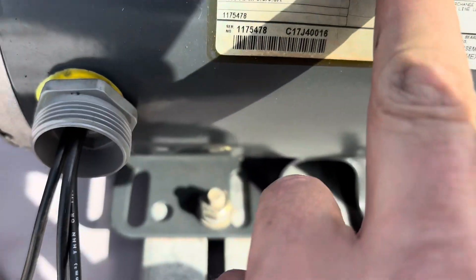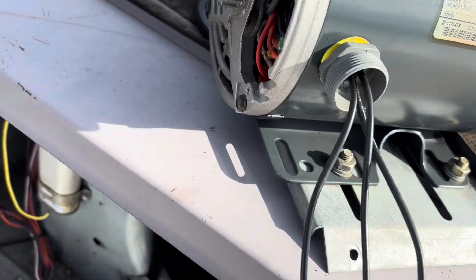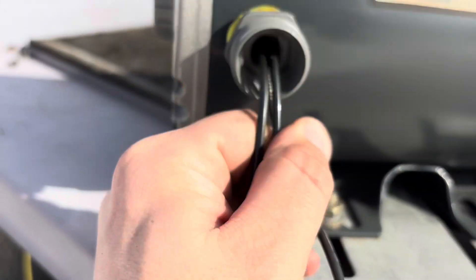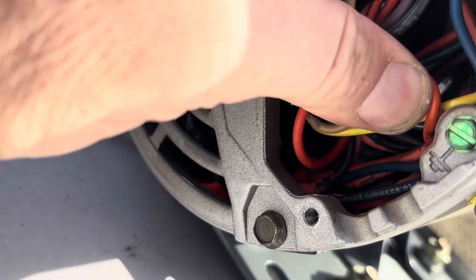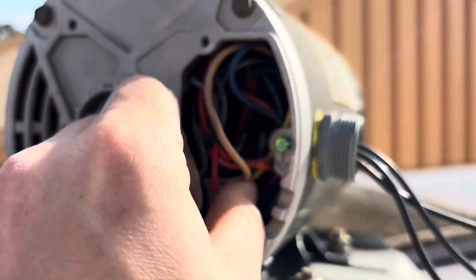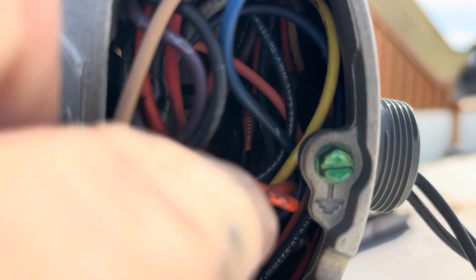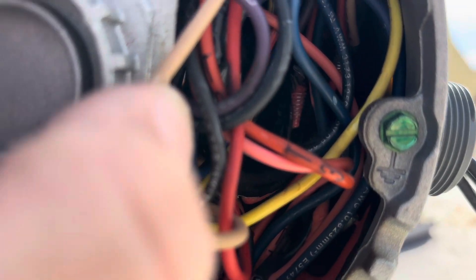She got hot. They gave me a new pulley too, which I will use so I don't have to take that one. Three wires connected somewhere here — damn, she got hot in there. Yeah, all these are stuck together. Trying to see where the hell they connect at; we'll have to pull some stuff out of there. She's all melted in there. The wires go in here but then they just disappear. Look at all this melted in here — all that orange in there is melted plastic. I think that was the wire nuts, because you can see those little springs right in there. I think wire nuts used to be there; this thing got so hot it melted them.